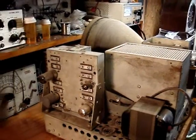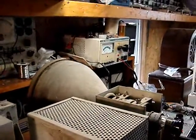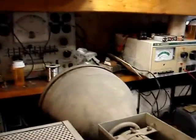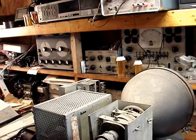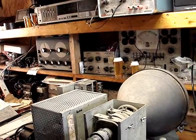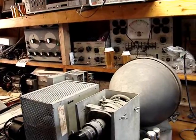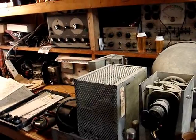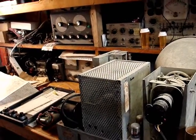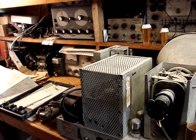So I'm making a judgment call here. I've got this very low emissions CRT. Now I do have in the basement an RCA — I made a video on that one. It's got a lousy looking cabinet, but it's got a fairly decent 10BP4 tube in it, and it may even have a usable power transformer. That one would have a transformer that supplies the 5 volts for the 5U4 rectifiers.